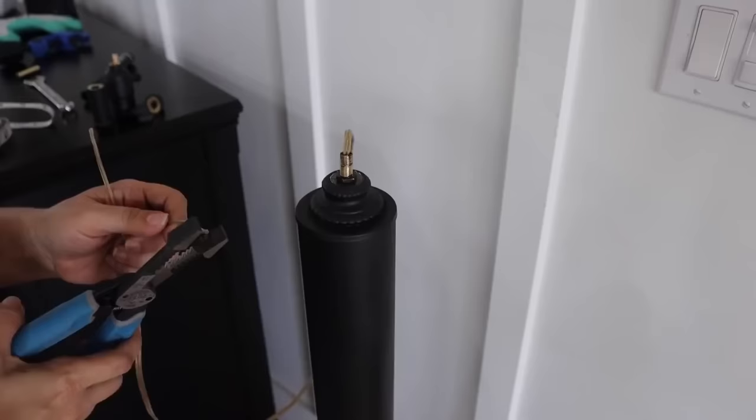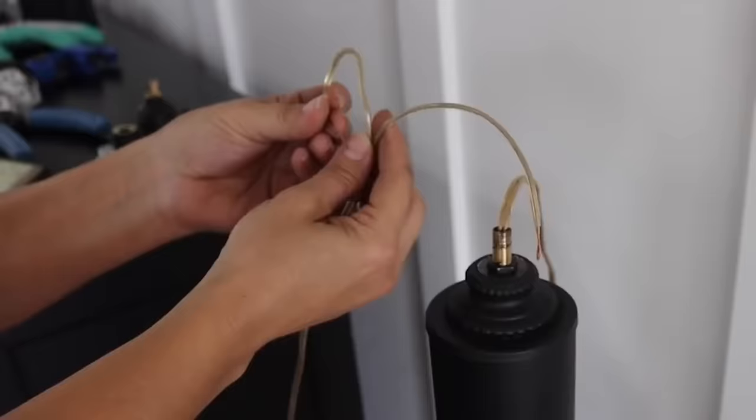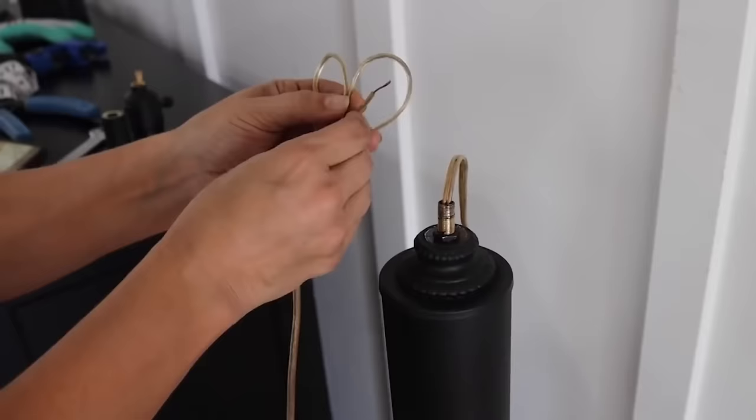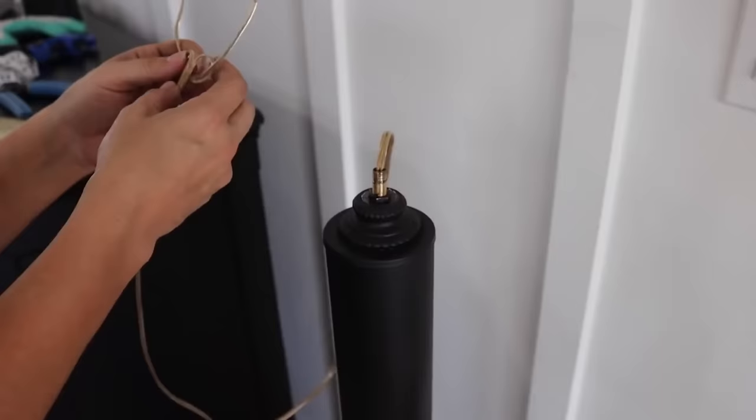She's amazing and she is so full of knowledge. And she taught me how to do an underwriter's knot, I think that's what it's called. So I followed her tutorial of how to make that knot, and I will link it in the description box below. And the idea of doing this knot is really important because that will prevent it. If somebody yanked on the cord, it won't yank our wire back through that rod and cause us issues down the road. So doing that knot is really important.